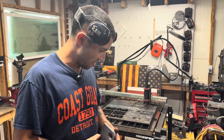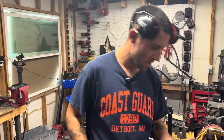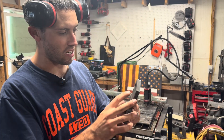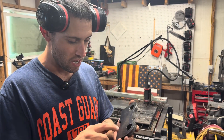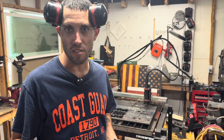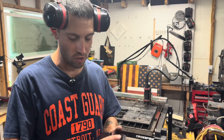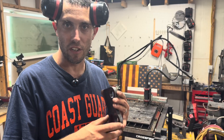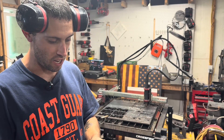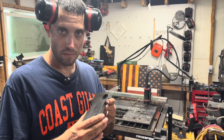These are going to be offered in half inch plate, and it comes with a plate that you can put in the middle so you can weld it together there. We leave a little bit of a gap for a weld bead. A quick note: they're plasma cut, so they are fairly accurate, but there's going to be a little bit of touch-up needed — whether it's clearancing a notch a little bit with a grinder. If you're building custom mini excavator attachments, I'll assume you have a grinder. I'm going to bore out all the holes to make sure the pins fit, or take a file to the ones that are really close.